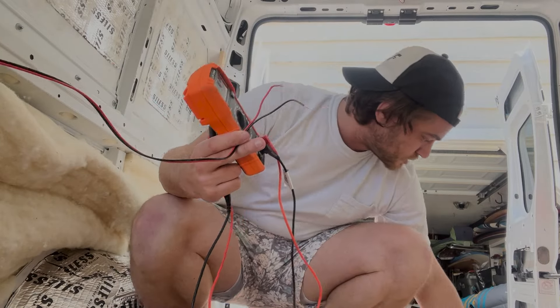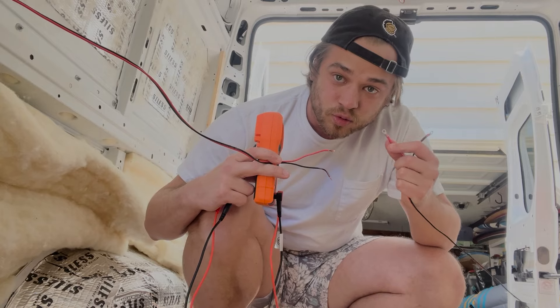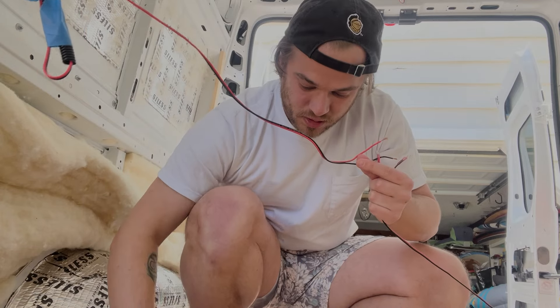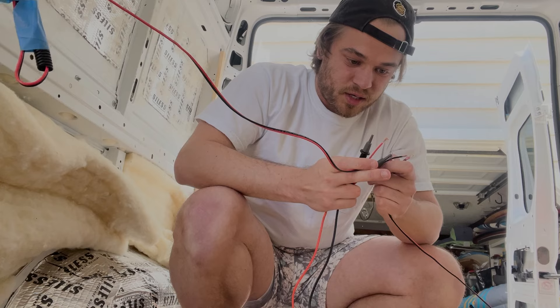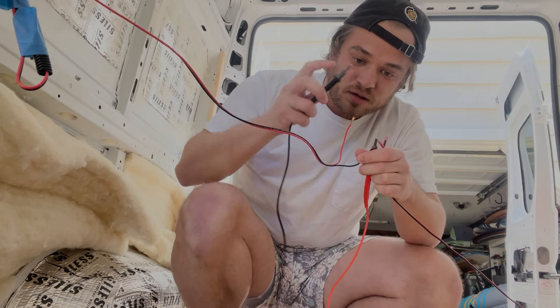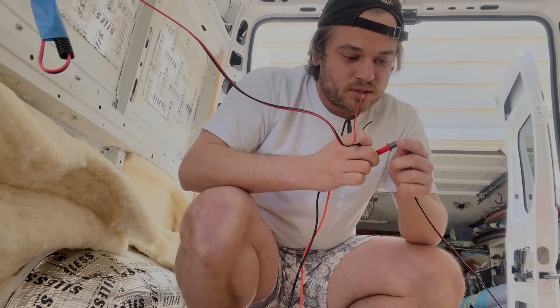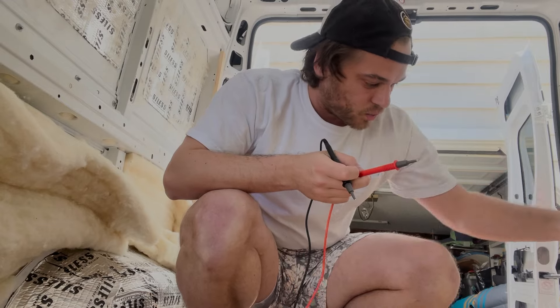Here's the stove connection that gets actually attached to the stove. What we want to see is that this red wire here that has the new crimp on it makes a sound when I touch this red wire. I'll just put my red probe here — you can see that's making contact with the red. And then what I want to hear is a beep. That means they're connected. Same thing over here — good, connections work. These are working. I'm just going to check the rest of them now. That's done — and they all have continuity. So DC wiring to get set up onto the DC fuse panel is done for now.